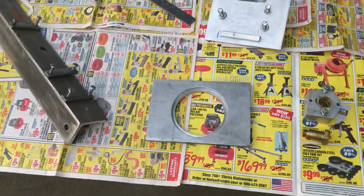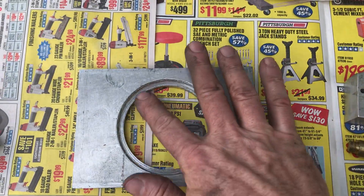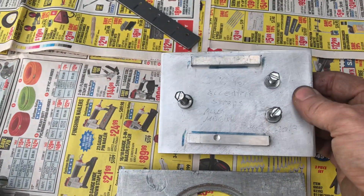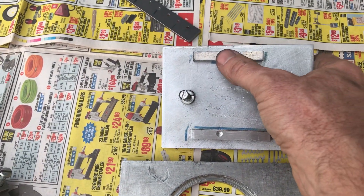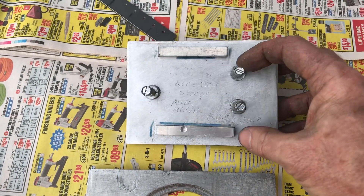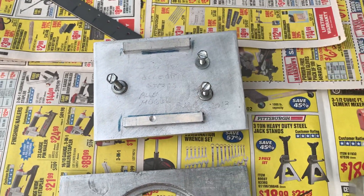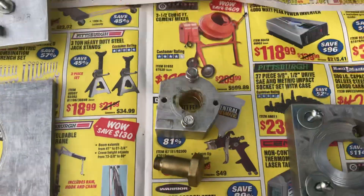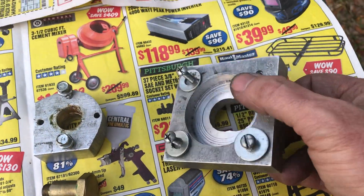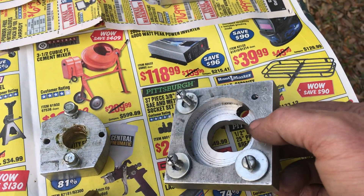Back to the making of the eccentrics — I made up jigs like this in various places to hold eccentrics. This one is for the eccentric straps. I put blocks here, I think I just crazy glued that on there, and then I had these to hold it down. It held it in place while I used a boring tool to bore out the center of the eccentric. Here's another tool that I made for machining them — you can see it's deep enough to hold the smaller part.